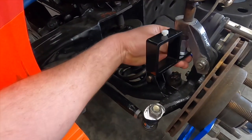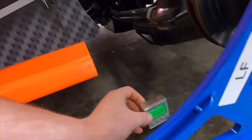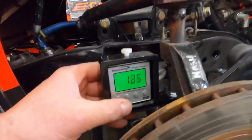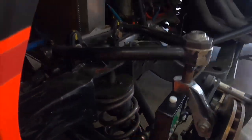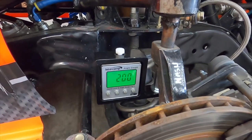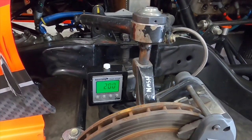I'm going to show you how easy this is — doing it one handed. Basically you just screw this on your lower or your upper and tighten your other bolts up here to hold it, or you can still move it. I like to set my gauge down here on the floor about where I'm going to be taking my measurements, and let's zero it out. Basically slide the gauge in the holder, screw that down, make sure that this is running parallel with your chassis — just put an eyeball down it. This right here is showing us 2 degrees caster. Go off your setup book your manufacturer gives you, and if you don't have one, call them. They'll tell you what your front end settings need to be.